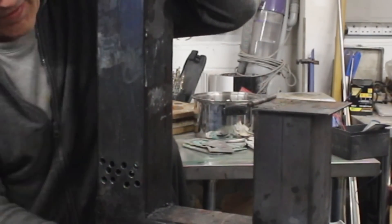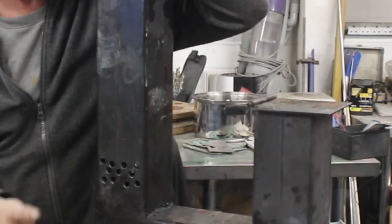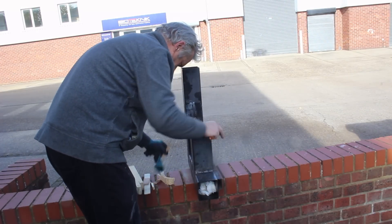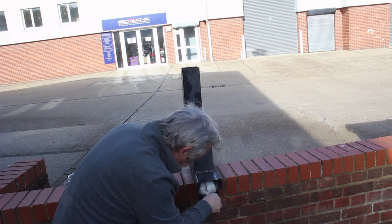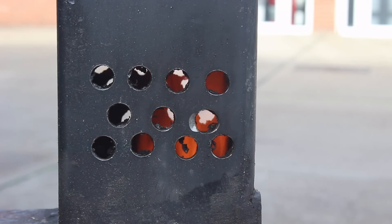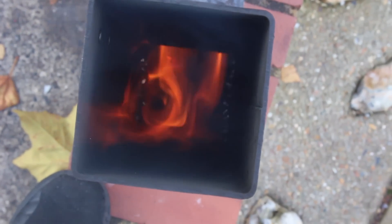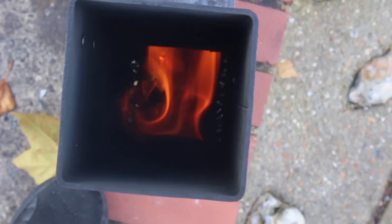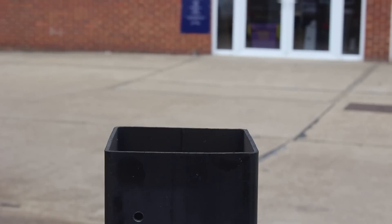The idea is: burn here, gases here, extra air, more flame, less soot. Now let's go and try it — oh, it's making a vortex! And that's a look at the exhaust. There's no soot, no flames coming out, which is really cool — because although flames look good, they mean combustion isn't complete within the chamber. Here we have complete combustion and all that's coming out is hot gas.